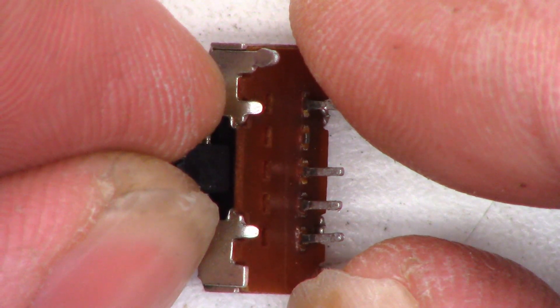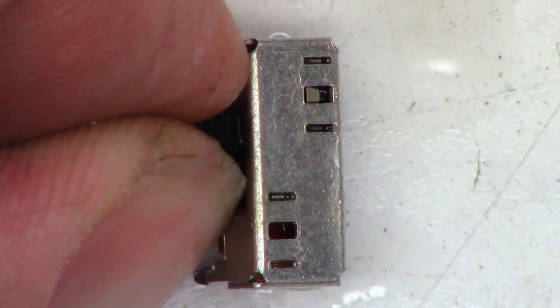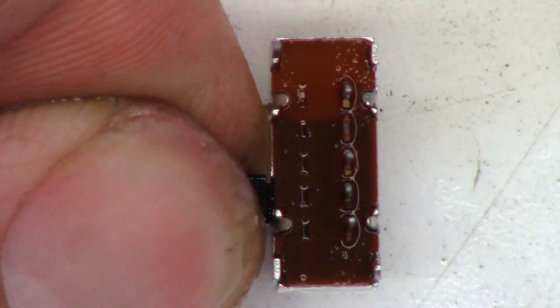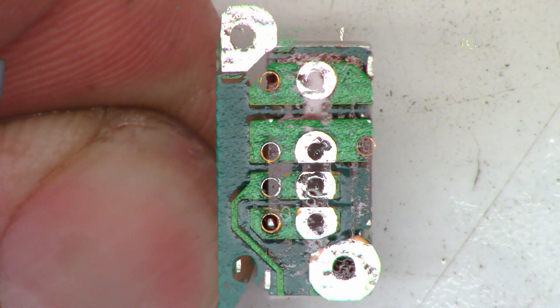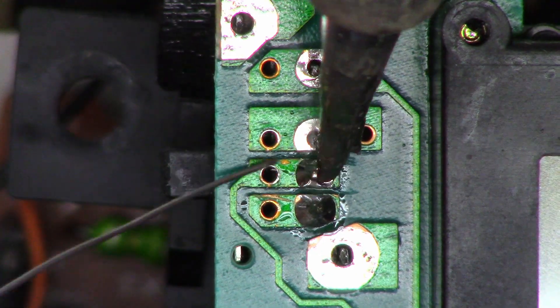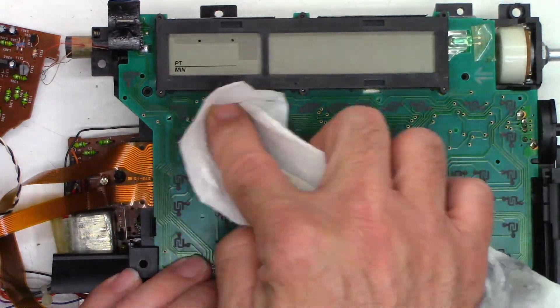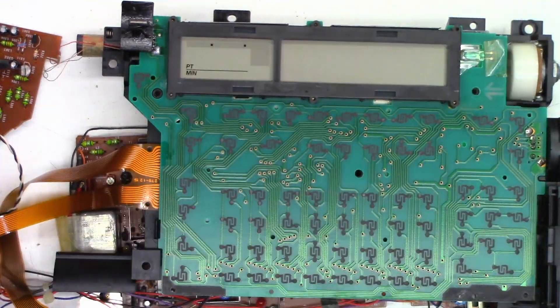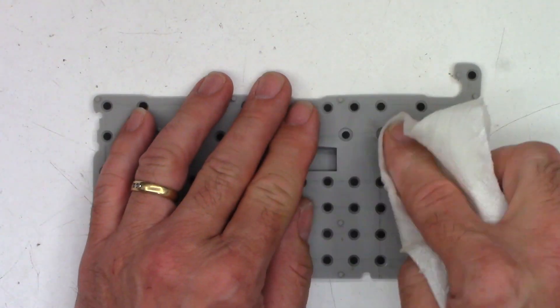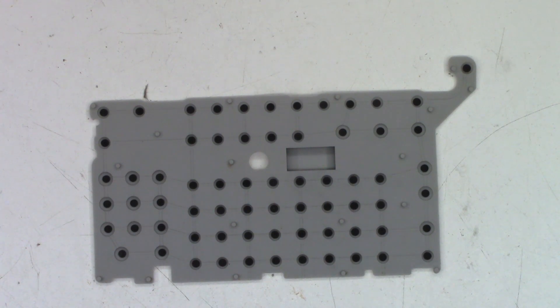Let's go ahead and clean the bottom of the switch the same exact way to get anything off of it. There definitely was something sticky on there that really didn't want to come off, but the terminals look absolutely perfect now. I'm going to go ahead and reassemble the unit, but before I do that I'm going to shoot it with some DeoxIT. All cleaned up — now we'll put it back in the unit. Switch is reinstalled, let's go ahead and solder it back in place. You can clean the carbon-impregnated rubber pads with acetone if you're quick — otherwise you have to recoat them. As long as you don't let it soak, I've been using acetone to clean these things for years — never had a problem. Probably 30 plus years at this point.